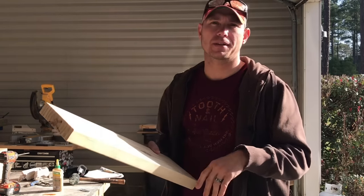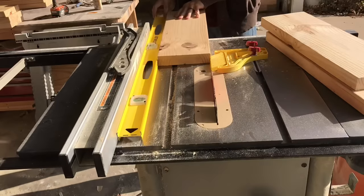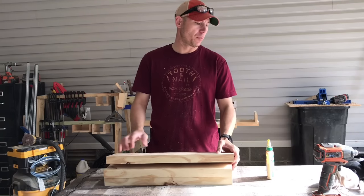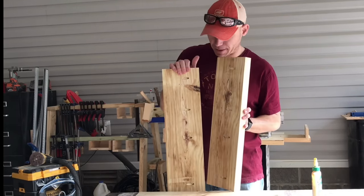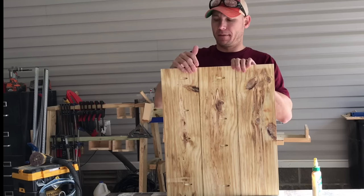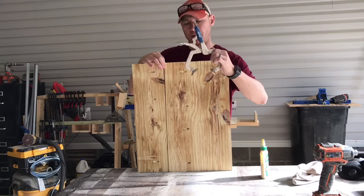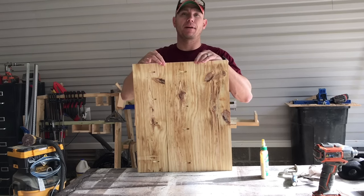That's what I'm fixing to do, then we'll start building these tabletops. I've already got pocket holes drilled in two of these boards — four holes — and then we're going to put a little Titebond wood glue on there and put them together using this pocket hole method. Three boards joined together, wood glue between the two joints, clamp them together, use the Kreg face clamp to get everything flush, then put those eight pocket hole screws in and we'll have a tabletop ready.